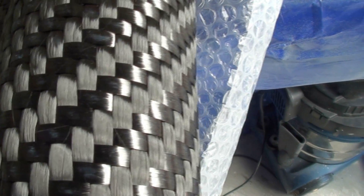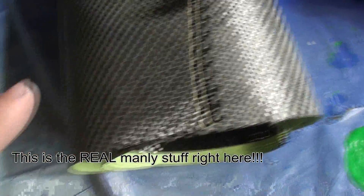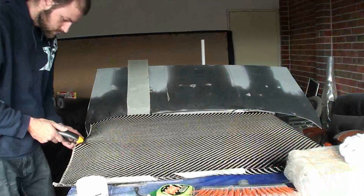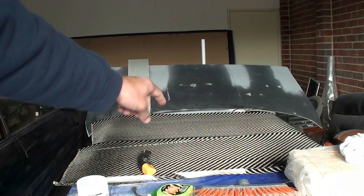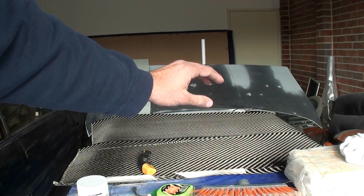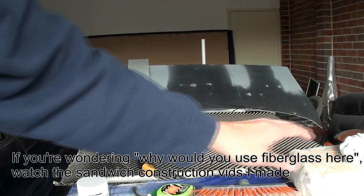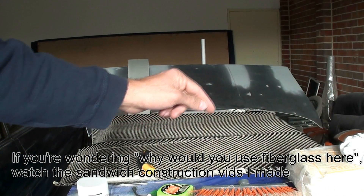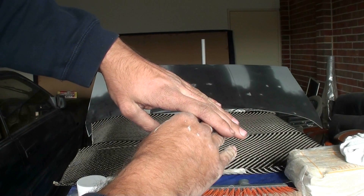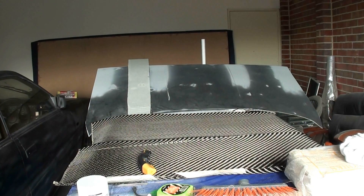Same tool pattern, just the same — but this stuff is thick compared to that. I'll have a sheet of this thick stuff on both the top and the bottom. In the middle there will be a number of fiberglass sheets, which I'll measure out later. The surface sitting on top that will be visible will have a thin sheet of carbon, mainly because you might get little pinholes where threads cross over, since the resin might not fill those gaps properly. I'll do it this way for now, and later I might make a smaller experimental piece.